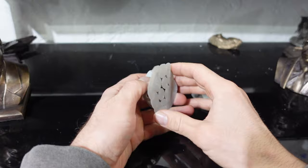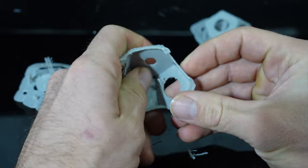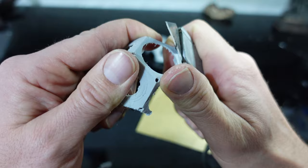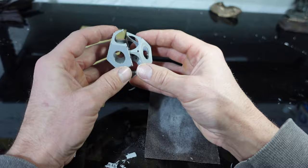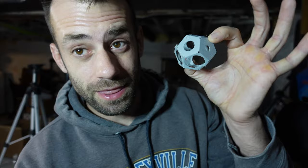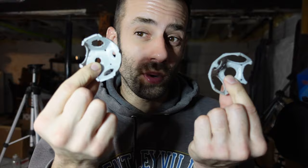To get a nice print, I had to do it in two pieces, so now I have to put them together. To do that, I first need to clean up the edges. There'll be two images of our dodecahedron — they'll fit together something like that. It's probably still not as precise as the ancient peoples. However, these are far too thin. Metal freezes very quickly, so to give the molten metal a better chance of getting all the way into these areas, I'm gonna have to thicken this up.